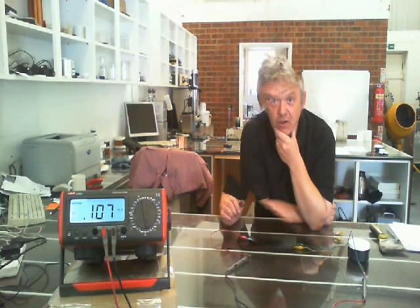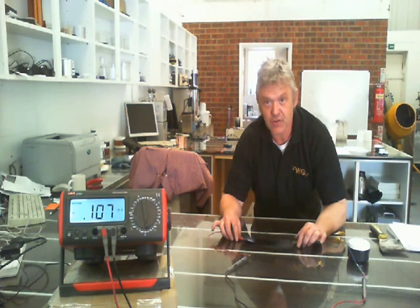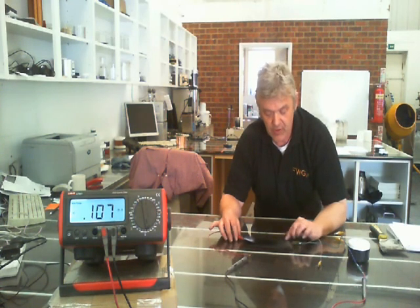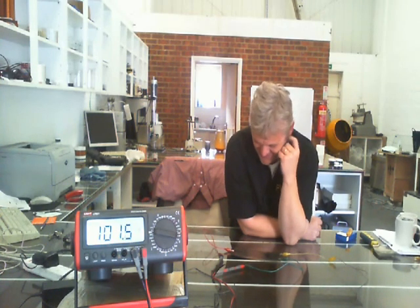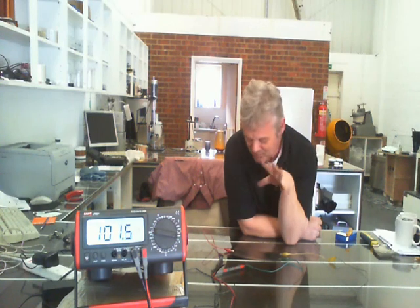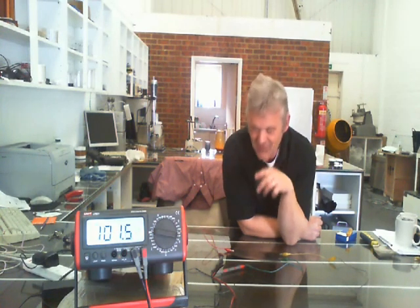So that's 107 microamps across it — that's very cool. If I flip those over so the two plates aren't touching each other and we've actually got a dielectric in between them, then we get exactly the same thing: 107 microamps. And you can see it's on the AC voltage reading giving out 101.5 volts. So you've got 100 microamps of actual power — and we know it's actual power because we've already run a television on a similar structure — and 101 volts coming off of there.